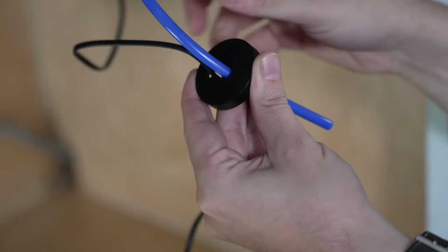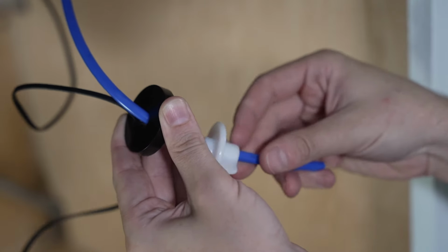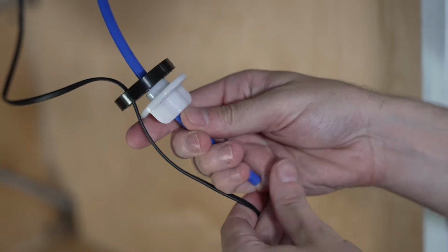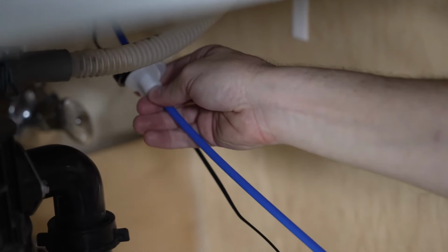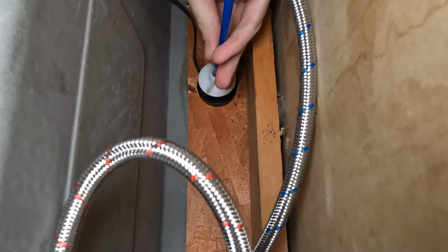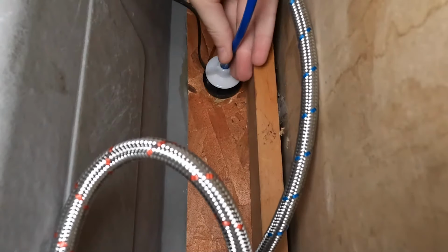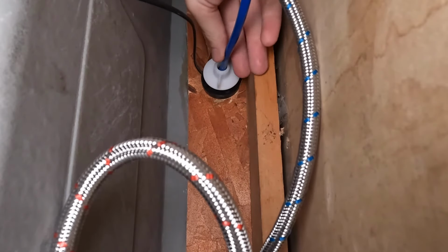Insert the faucet tubing through the main spacer hole and guide the spacer onto the faucet stem. Be sure that the cable remains in the notched area of the spacer as you slide the tubing and stem through the spacer to avoid damaging the cable. Thread the wing nut onto the faucet stem and hand tighten. Final faucet positioning may require 2 people when tightening the wing nut.